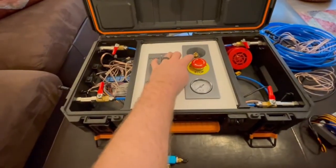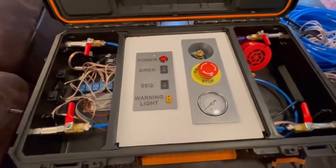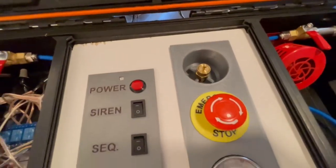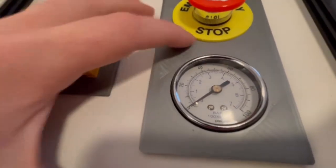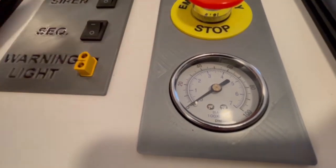This manifold has a pressure gauge and also a blow-off valve so that students can't pump it up too high. That will blow at 100 psi, so they should only ever be going up to about 30 psi — we don't ever need to go any higher than that.